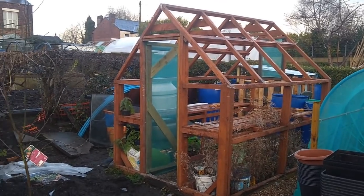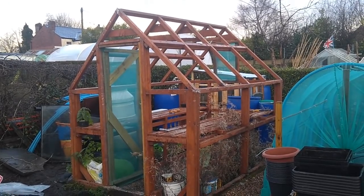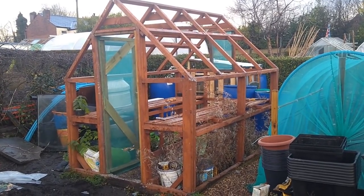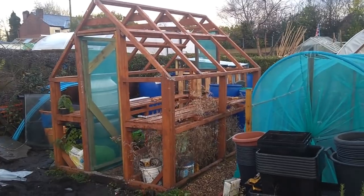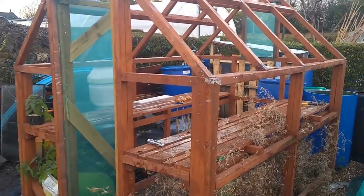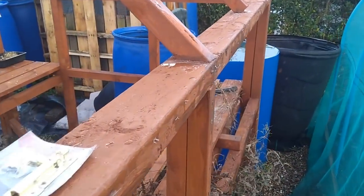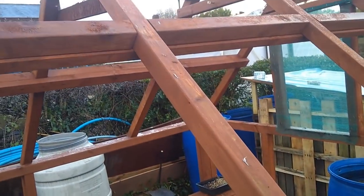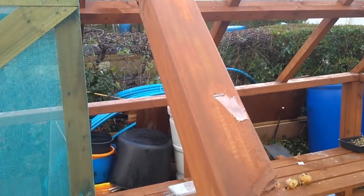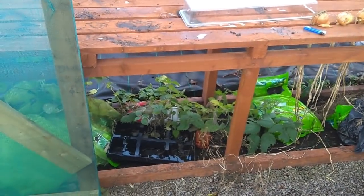So now all the asbestos removal polythene sheeting, 1000 gauge visqueen, that was on it has been removed. There's just a bit of titivation to do, and by titivation I mean removing any residual plastic that's left on, that you can see there bobbing about, and either de-stapling or flattening down the staples so they're not going to affect the new covering. We're also going to clear out the weeds that have grown up inside over the last few months.